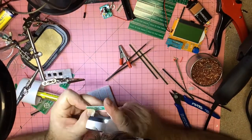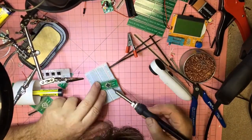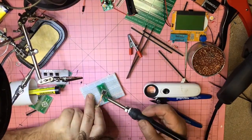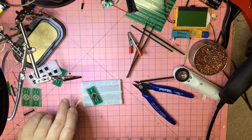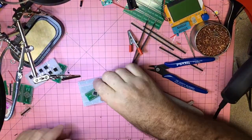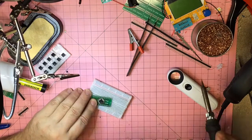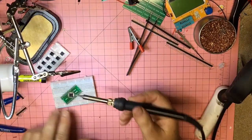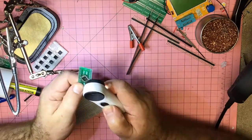With bridges you can either use a soldering iron to pull some of the solder off, or in this case I used a little bit of soldering flux and then some soldering braid or wick to wick away the excess. Some people do this as a fairly standard technique — just drag the solder across the pins and wick away the excess. It's a pretty straightforward method.